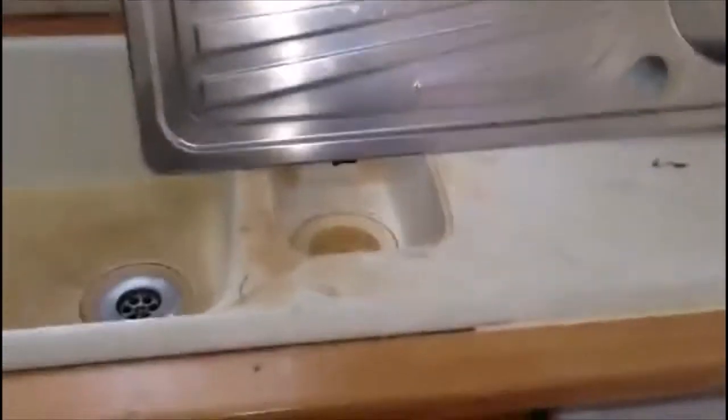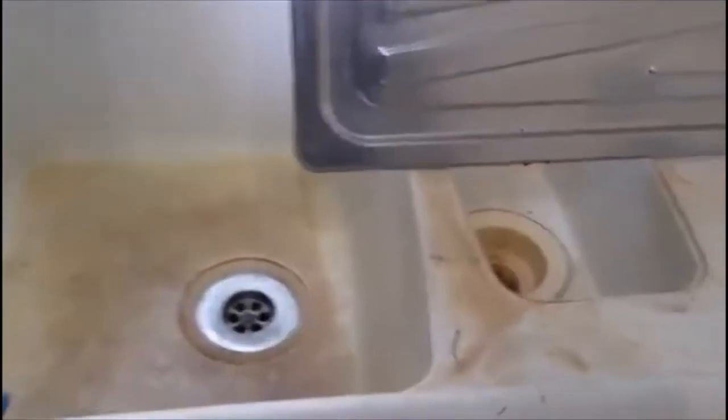This is just for cold water. As I told you, you must also find the isolator for the hot water and isolate it too. Then, when both hot and cold water are isolated, you start removing all the drain pipes. In the next video clip I'll show you that. As this sink is larger than the old one, we must cut the worktop a little bit to adjust it. If the new sink is smaller of course it won't fit, but fortunately this one is slightly bigger so it will fit.